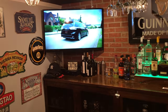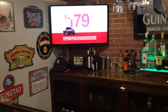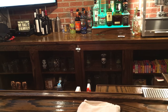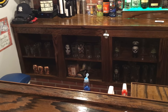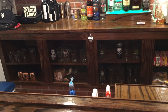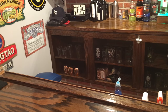That's a 43-inch Vizio smart TV above the bar — I actually watch a lot of shows on it while my kids use the big screen. I have two separate cable boxes down here so we can watch two different feeds. The back shelving unit I built the same way as the bar: framed with two-by-fours, stain-grade plywood with oak veneer, solid red oak moldings, and three-quarter inch ply shelves with laminate edge strips. The shelves are adjustable using the same Amazon shelf pin jig. Everyone starts buying you bar glasses once you have a bar down here.